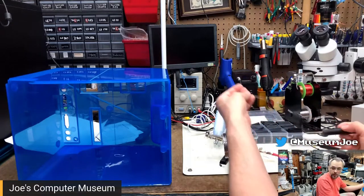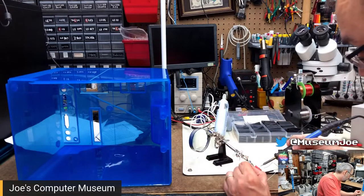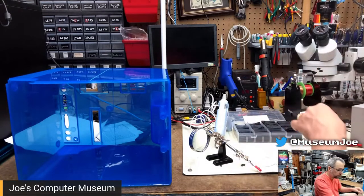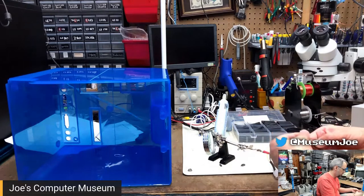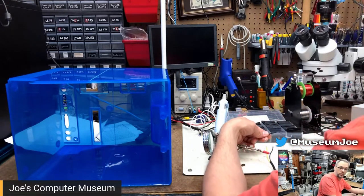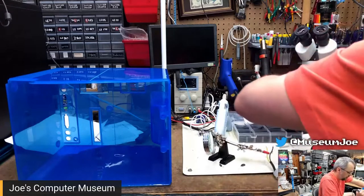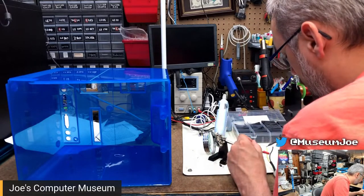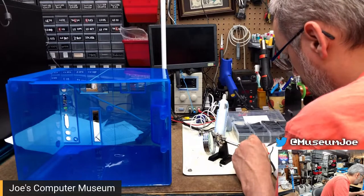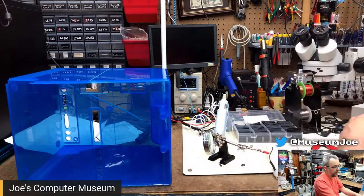just like this. I'm not sure if you guys can even really see what I'm doing here. Kind of doing this all side cam weird. Retin that. And then this goes here. This is our positive voltage. This goes on there, and we just tack it together. Tack it together. Did I not solder that properly? Apparently, I did not pre-tin that lead well enough. Let's do that again. Soak it with the solder. Just soak it all up in there. Just get all up in there. Lots of solder, please. To keep the smoke away from my face, I just blow out a little bit while I'm doing it.